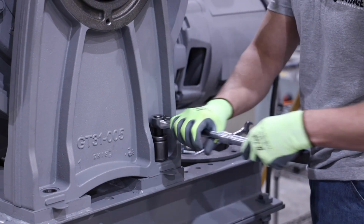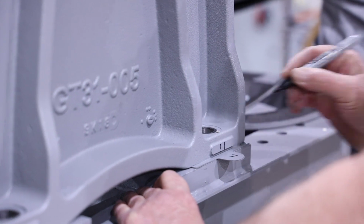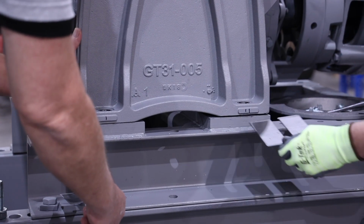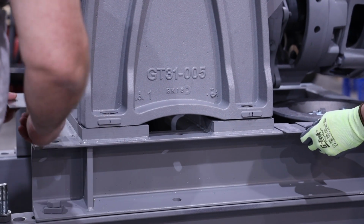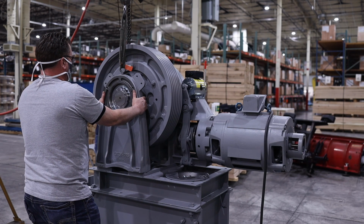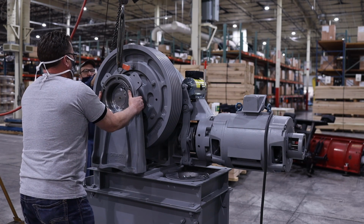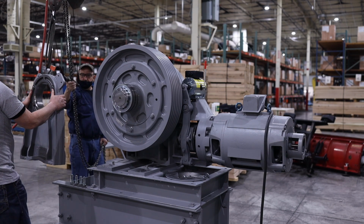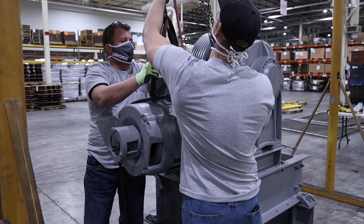Before pulling the outboard stand off the bearing, be sure to mark the number and location of shims under each mounting location. It may be necessary to slightly pry up on the outboard stand to remove the shims. Once the shims have been marked and removed, the outboard stand can be pulled off the bearing straight and level, being careful not to pop the seal on the bearing. It is a slip fit and should not require excessive force or a pulling device.